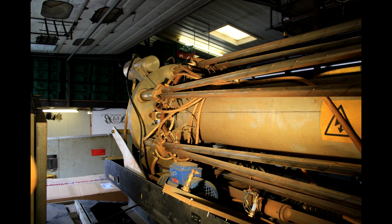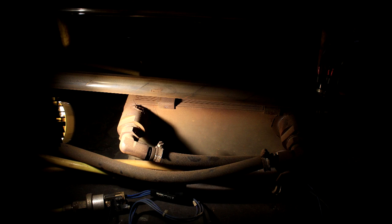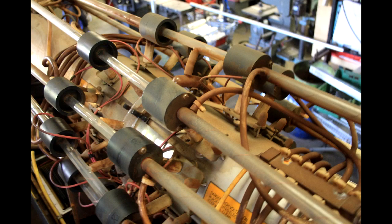The cooling circuit runs at this voltage, so instead of water they use a substance called fluorinert, which is a very inert liquid with a very high dielectric strength commonly used for this application. The laser tubes are concentric — you've got the gas tube in the centre with a sleeve around the outside. There's also a spiral electrode designed to carry the discharge along the length of the tube. The coolant goes through a heat exchanger into water and then an external water circuit with an outdoor chiller. With 28kW going in and only about 1500W coming out, almost all of the power is dissipated as heat, and everything must not get too warm or it will knock the mirrors out of alignment.